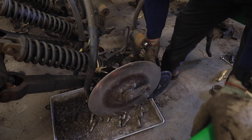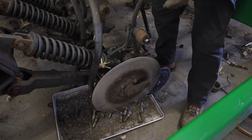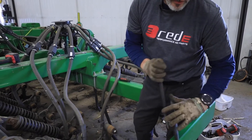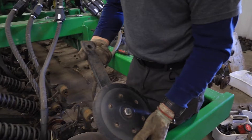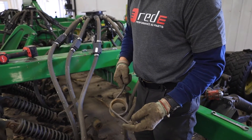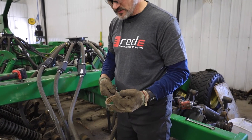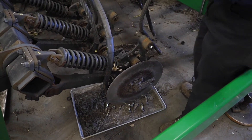Here we can go ahead and run the disc off. In this case I want to take the firming wheel arm off first — it makes it a little bit easier to get that disc off. Check this bearing on the firming wheel, make sure that it's good and ready to go — and it is, so it's good to reinstall. Firming spring — as mentioned before, we'll be reusing the spring. You can see there is a little bit of wear in it, and a lot of times we'll go ahead and replace these, but we're reusing it in this case. Take the disc hardware off with a 9/16 socket on the impact wrench.